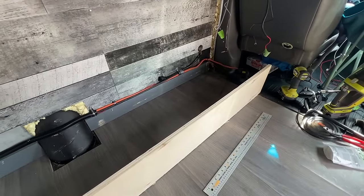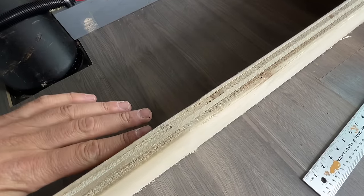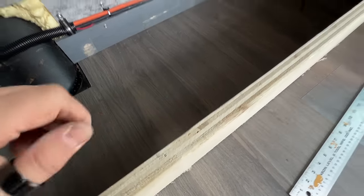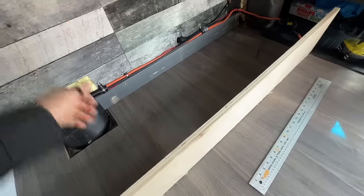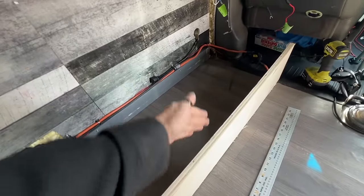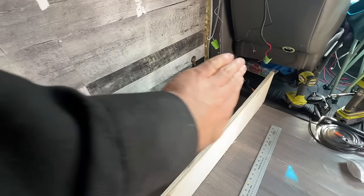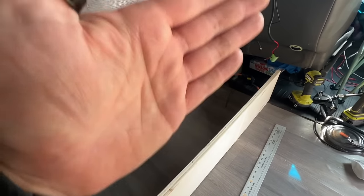So yeah, now it's either a trip to Silverton to get the paint, which is probably what I should do, just so I can start painting this, because it'll dry nice and quick. And then we got to build the framework, and this is what I was talking about earlier. Instead of the 2x2 frame being flush with this, I'm going to sink it down either 1/2 inch or 3/4 inch, so that the lid for the diesel heater, when it folds down, is flush with this, and then the 2x2 will still brace it. So it's the same theory, just the siding on the box is going to be taller than the frame.